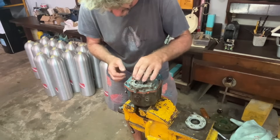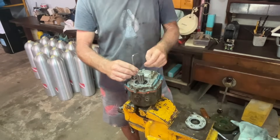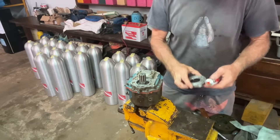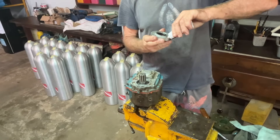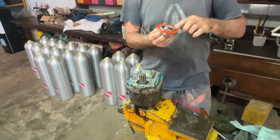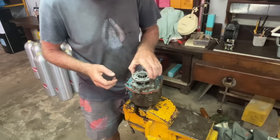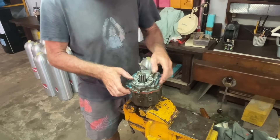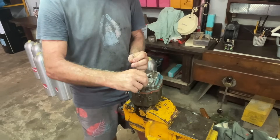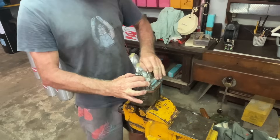End casing on. Now put in the bolt onto the floating shaft - put a bit of sealant around that as well, it's a very important one. One countersunk washer, put the bolt in, do that up relatively tight - although it does self-tighten so you don't have to worry too much. Now the cap on the main thrust shaft: put some more sealant on that because it's keeping the oil inside. Same thing - put that on nice and straight, pull it down slowly with the bolts in a circle.